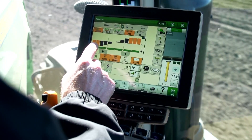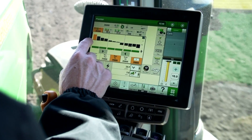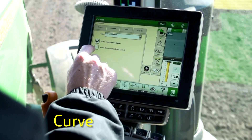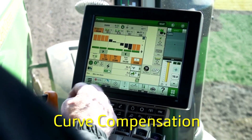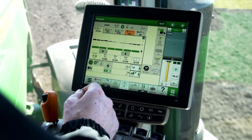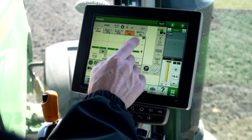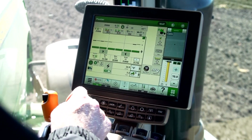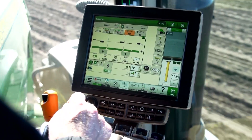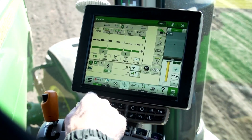Now we're curving to the left, and you'll see how it's going to be high on the inside of the turn and low on the outside. So now if I go back and turn curve compensation meter control on — this is how you would normally run in the field. It's going to compensate those curves and adjust each meter individually for optimum performance. You'll see it's green, indicating it's actively controlling for that curve, and we've got a nice straight line across maintaining accurate population, even curving to the left — still maintaining consistent population across the planter.